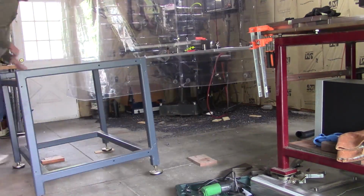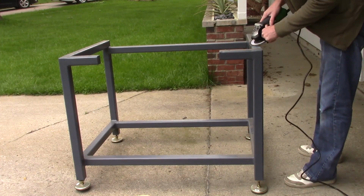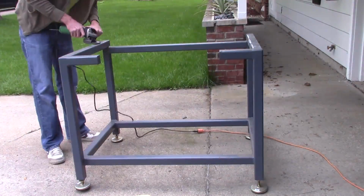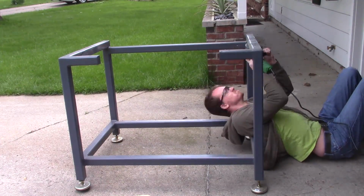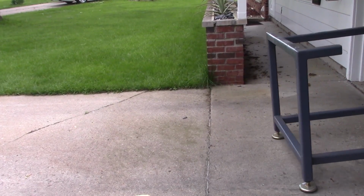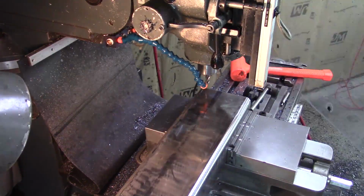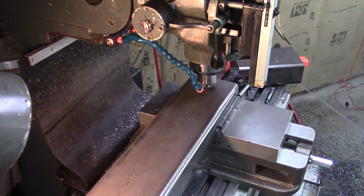The frame has to be removed in order to prep it for welding. Now to prepare the cross members. I took a few measurements and wrote a quick program to make a notch on each side of each end that would put these supports just about 1/32 of an inch below the plate. Remember, we don't want them touching the plate because they certainly aren't flat. They will just support the more precision steel tubing later on.